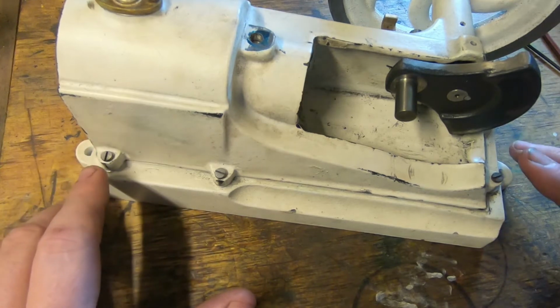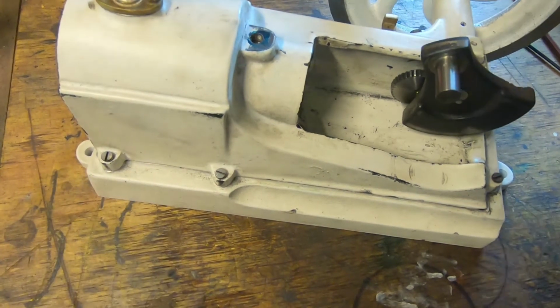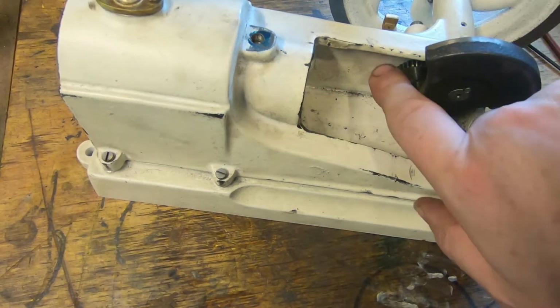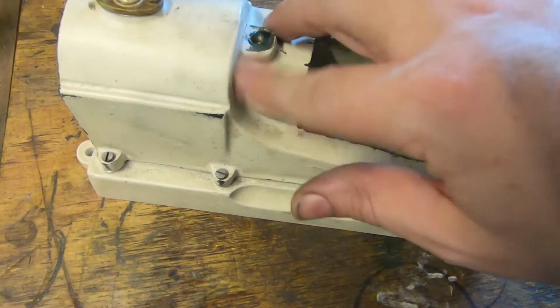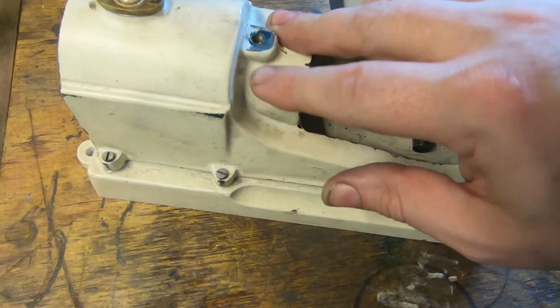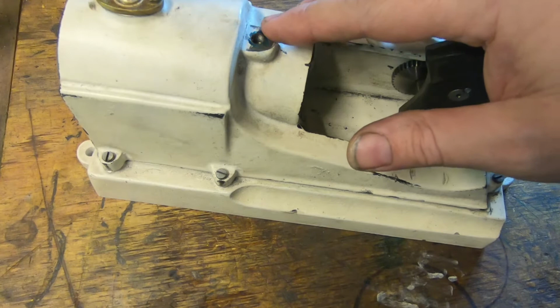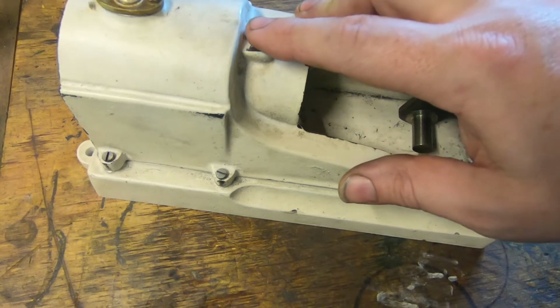One is the cams, and that's probably something we should do because last time we got this cam gear in here and working nice. But we need to make an oiler for here. And this is threaded quarter 40, which is model engineering pipe thread. It's fairly fine thread.